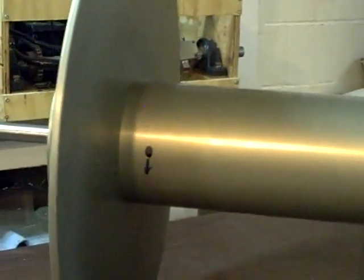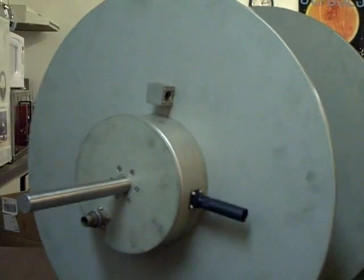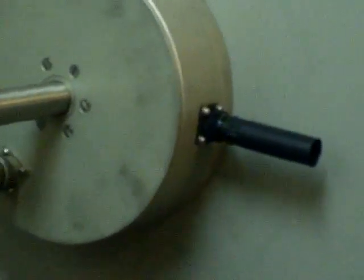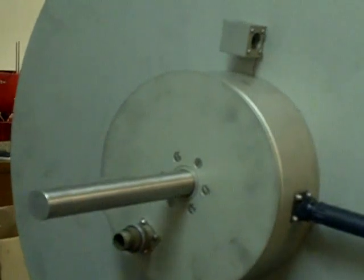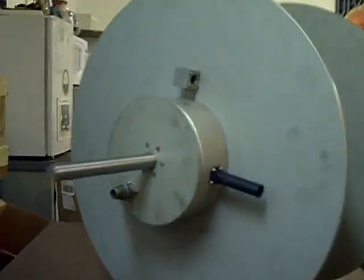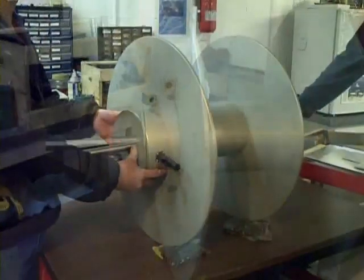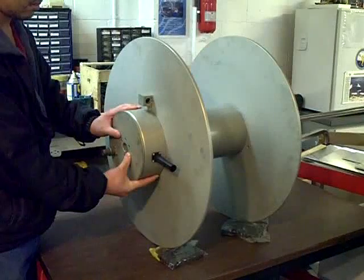You have to take off the outside of the drum. On this side over here, the little connector housing up at this point is where your cable from the interior of the drum is terminated. It goes over to the connector on this side, on the slip ring, and then exits through that connector there. This whole series of parts are completely independent of one another. It's very simple to disassemble or assemble the unit by simply withdrawing the axle and then bringing the slip ring away.